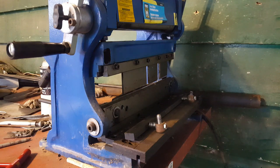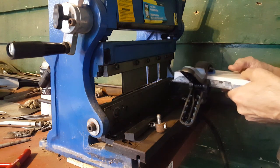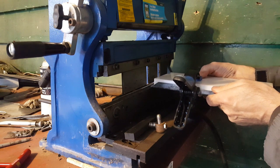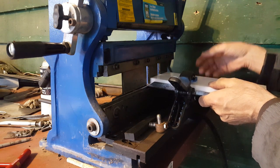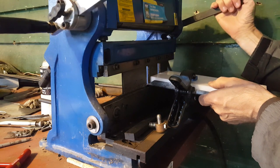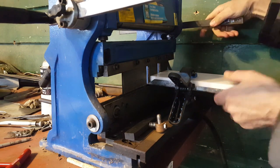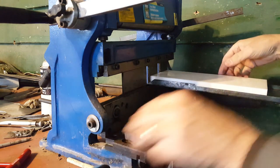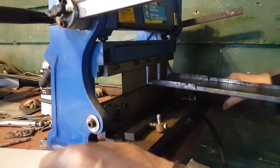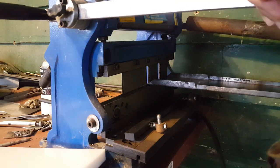So first I'm going to position this at the split fingers, which will do the bend out to the full width. Now I see my clamp is a little in the way here. So I have to move it back a bit. I'm just gently holding it so the white block is against the face of the finger. Start applying the presser until I feel the thing grab the metal. I can take off the clamp, take out the block, and rather than killing myself applying force, I'll just use the pipe to lengthen this a bit and do the bend.